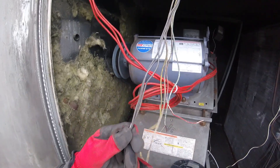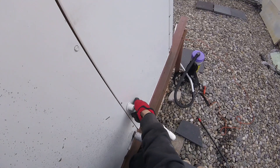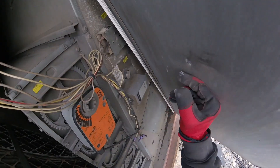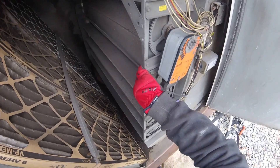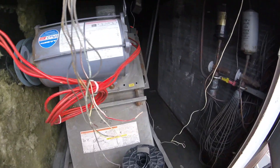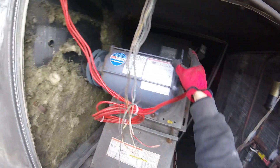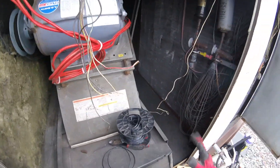Got some stranded wire, we're going to connect color for color, wire for wire. Once we got our colors connected, we can finally trace out the wiring that we don't know. I see that the three black wires — I'm not sure where they go — it actually goes here. Looks like it goes into this enthalpy control and works with this damper, which I don't even think this thing worked to begin with. That safety limit over there — limit switch — is disconnected.